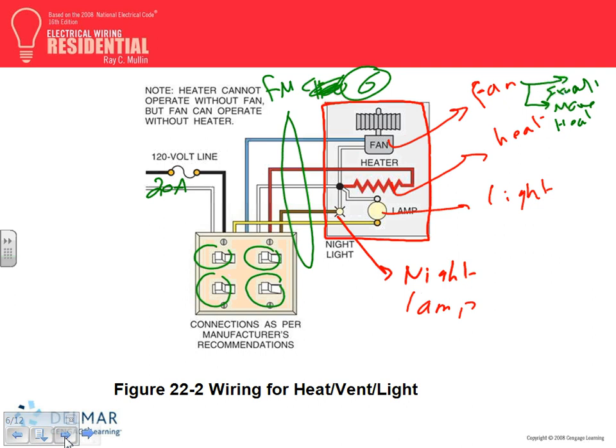Now, another option, guys, is you can take a 12-3, which gives you three conductors, 1, 2, 3, and then grab another 12-3, because you have to have another neutral. So two 12-3s, plus ground, with two neutrals. Two 12-3s should be okay, tied to the equipment. Any questions, guys, about this piece of equipment? Heat, cool, everything in all one? So that's here.